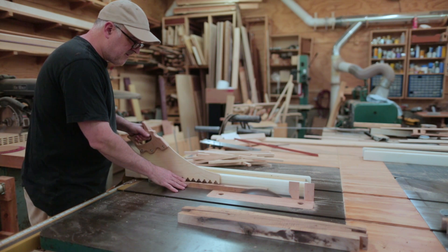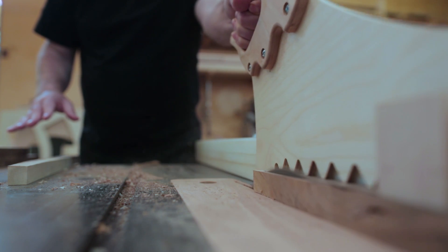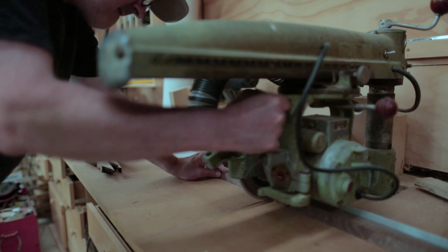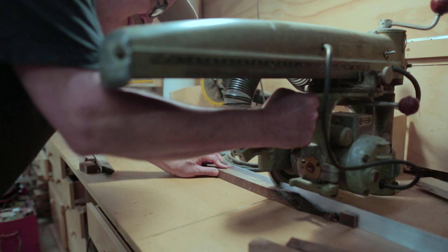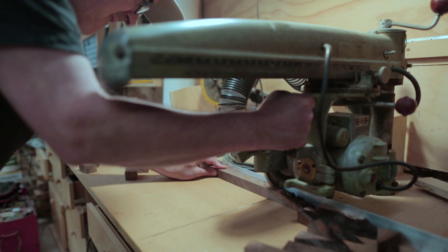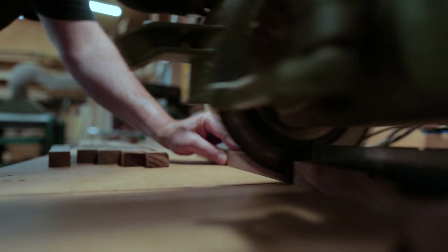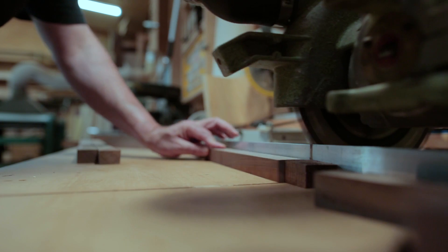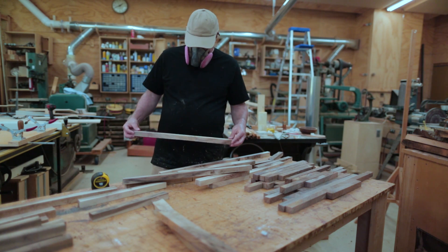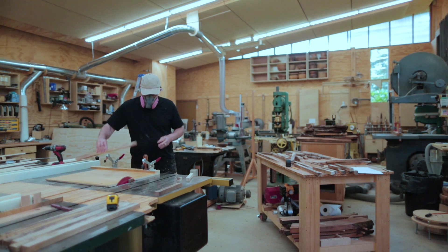Once I had the rough strips on the bandsaw I could re-joint and run them through the table saw to get a smoother and more accurate width. Then I needed to true up the ends and find places within the strips where there were defects — knots, cracks. So there was a lot of cutting the strips into the blocks I needed for the glue-ups to make the surfaces to then carve the terrain. It was a little like doing a segmented bowl where I was making a whole bunch of segments to glue up into a larger piece to then be carved into something else.